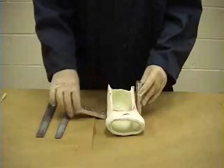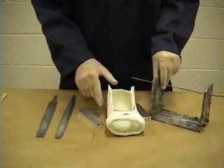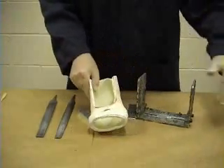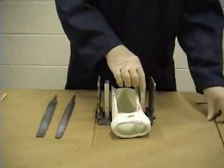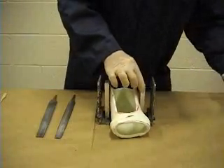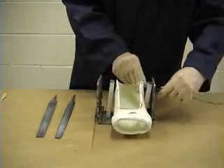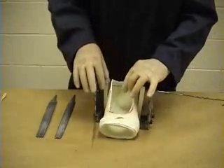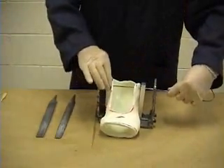The posts are going to be glued in position, but in order to get them in exactly the right place we need a jig. This is a model of the manipulandum that's mounted on the actuator, so it has the same dimensions. We're going to assemble the parts in this jig in the right order, and to keep everything at the right distance we'll use this piece of wire from a hanger. We go through the first post, then through the hole which is the axis of rotation of the boot, then through the other post, and out the other side of the jig.